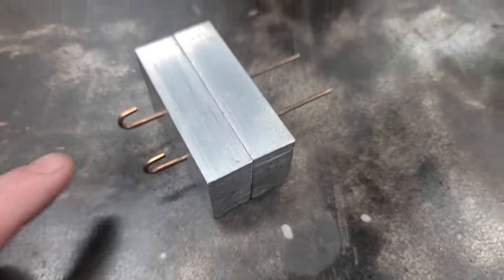The purpose of the 1/4 inch hole, now you notice how these little holes kind of line up with the big ones. When you're drilling it, don't hold it real tight. Let the drill bit line itself up with that little hole in there. I basically drilled the 1/4 inch holes just as a little lead hole for our next drill bit. Now, on one of these holes, I'm gonna take a 1/2 inch drill bit, and I'm gonna drill down about 1/2 inch on each side.